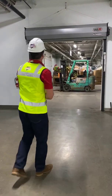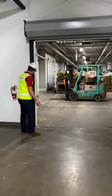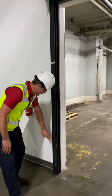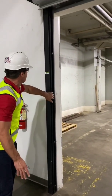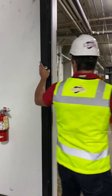I would open the door and check for any visual damage — that's one thing I look for as an installer and certified inspector. Make sure the tracks are all healthy; you can see there's no damage here. Maybe a few scuffs or marks, but that's not a problem. We're looking for anything that would impede operation of the door. We have nothing on the tracks — that looks really good. We've identified that the door was installed properly.